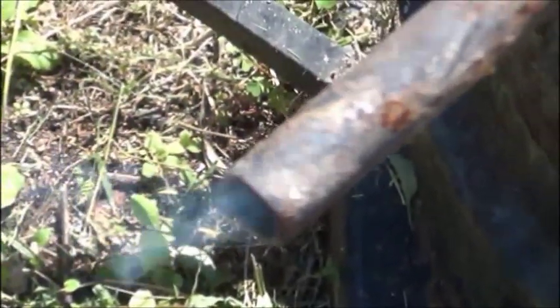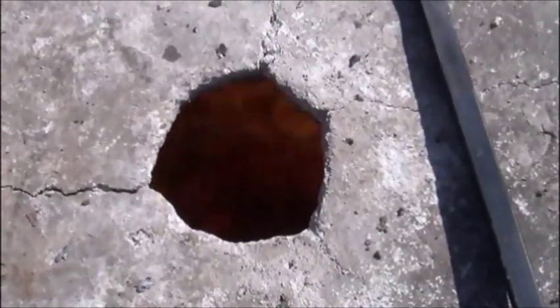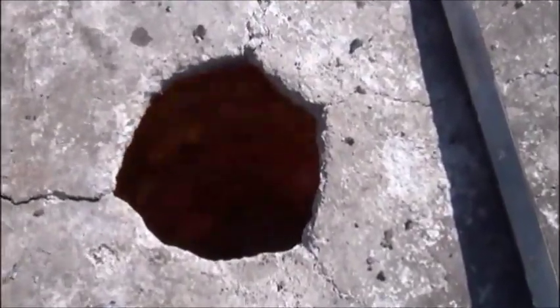And you can see my pipe is open to the inside because I've had a bee's nest in the pipe this time, and we're burning them out anyway. Probably about 5 to 7 minutes. You can see the crucible is getting a nice, kind of dull red for the most part, almost cherry red. Aluminum is about half melted.